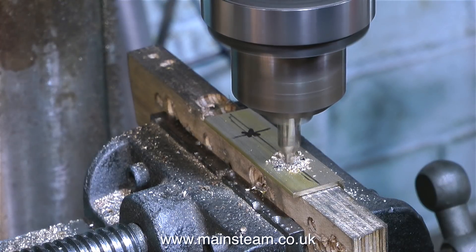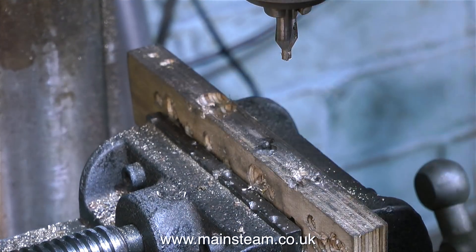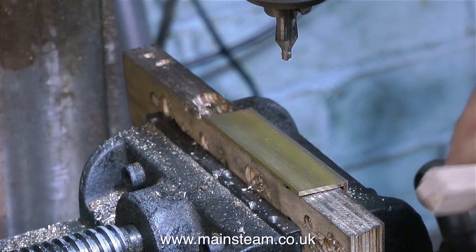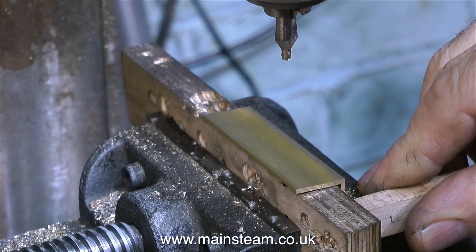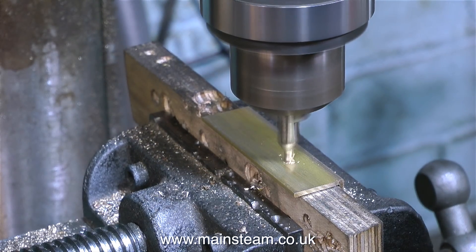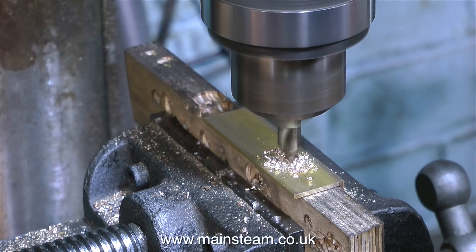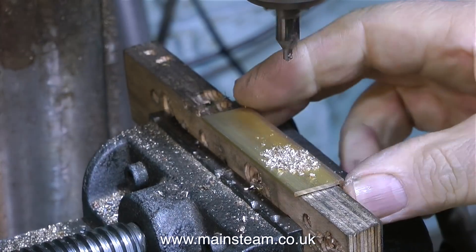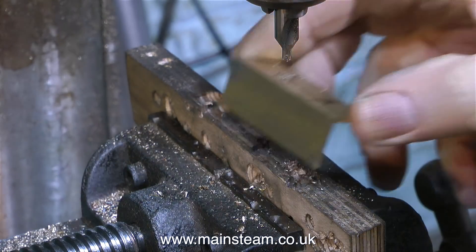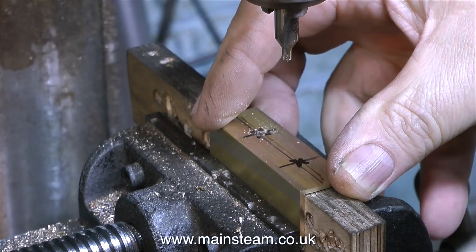Over now to the drilling machine to drill the pieces of brass angle. I've marked out — and I use that term very loosely — the position for two holes on one of the pieces of brass angle, but I haven't marked out the second one, because by duplicating the position of the brass angle in the machine vise, I can drill the hole in the same place. For any experts watching: yes, I do know about the graduated vernier dials on the handwheels of this cross vise. But a lot of beginners will not have a cross vise — they may have a machine vise in the drilling machine, but that doesn't allow for any adjustment. So as always, I'm trying to show a very simple and easy way to do the job, without using numbers, dials, or anything technical.